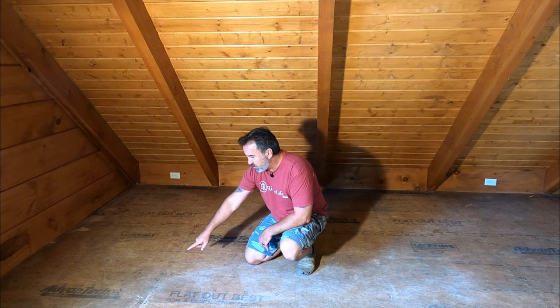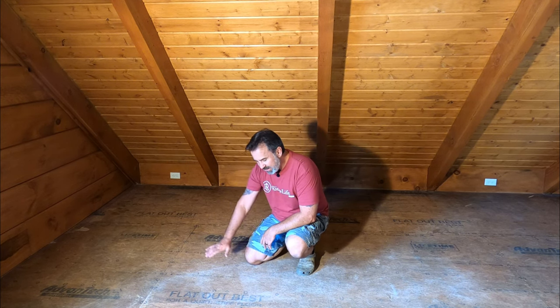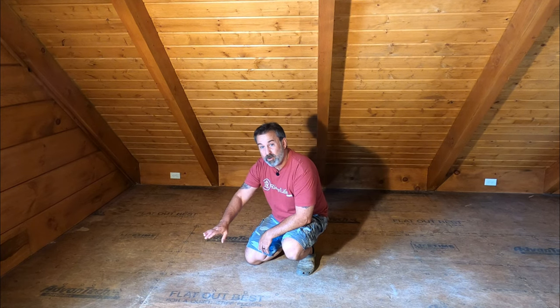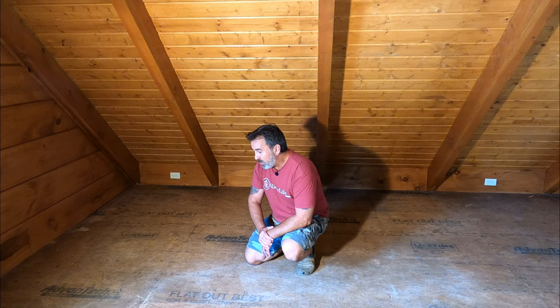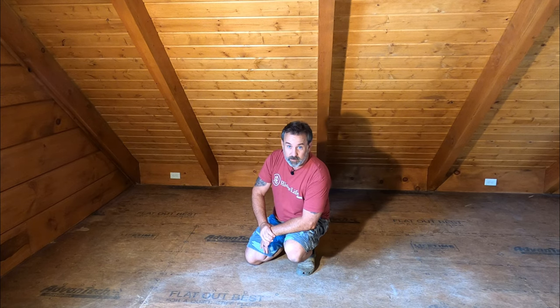We had a few places where our subfloor wasn't level and we had to sand them smooth. That way there's not that big deviation. Now it can account for some. You want to make sure all your nails and screws are hammered or screwed in tight as well. That makes sure the floor is nice and secure and there's no protrusions up into the underlayment of your LifeProof flooring.